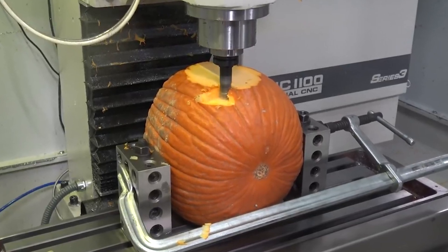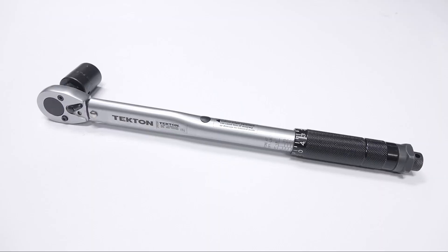One last note: one of the keys to long-term process reliability and accurate parts is being consistent. Vises will be incredibly consistent if you apply a consistent amount of force to the vise screw, and the best way to do that is with a torque wrench. Consider setting aside the vise wrench for loosening only, and instead use a torque wrench set to a specific value so that the first, tenth, and hundredth part you clamp all receive equal clamping force and clamping pressure.